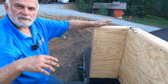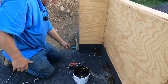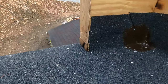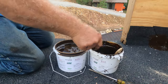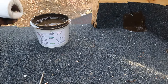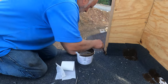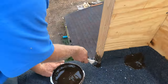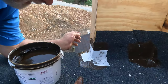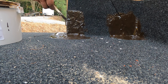Any place where you have a transition or flashing, use turbo poly seal — it's the easiest thing to do. Look at this corner here — that corner will leak without sealing. Cut a piece of fleece, cut a slit in it, brush turbo poly seal on the corner wood, put the fleece in place, and that's it — that corner is sealed, no more leaks.